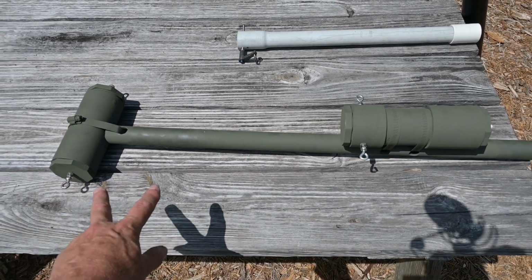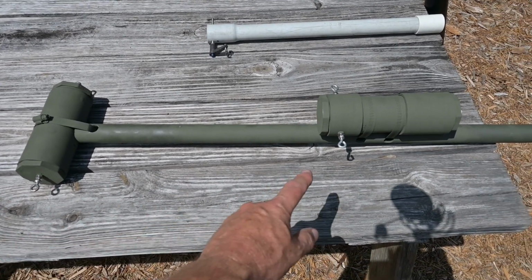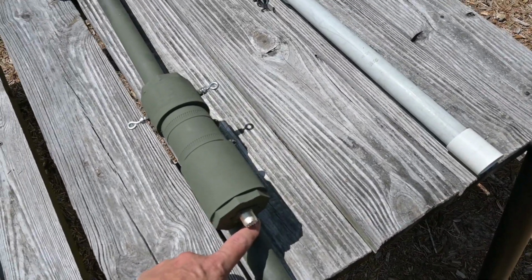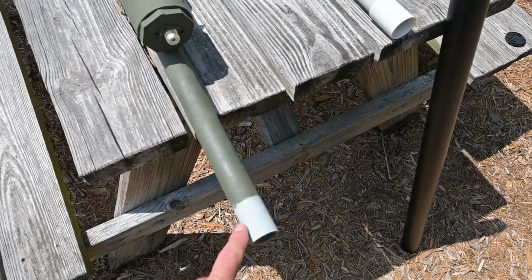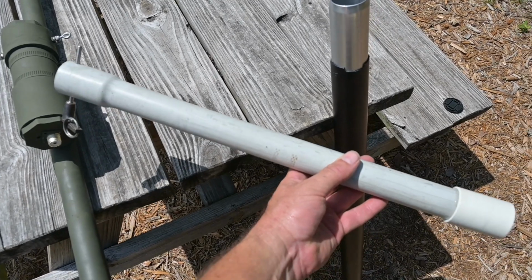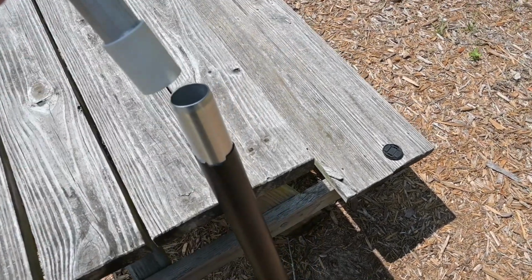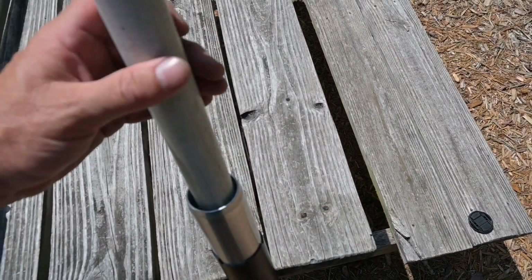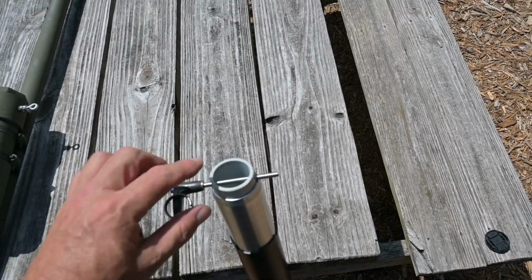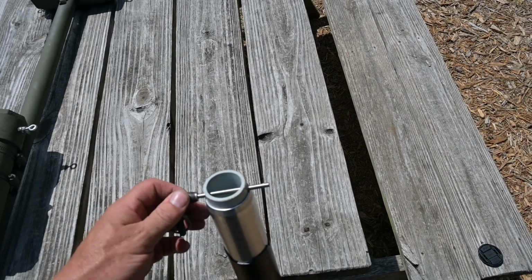So this right here eliminates that necessity because it gives us a nice perfect spacing of 18 inches at the feed point. And over here's our RF connector. Now you'll also see down here that I've removed the paint and I've constructed this right here. Now, one of the tools I have in my toolbox is a blue sky mast, and this right here is the perfect bore diameter for the blue sky mast sections, and this gives it enough space away from the aluminum mast to reduce its potential for interfering with the operation of the antenna.